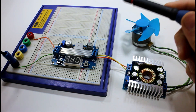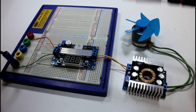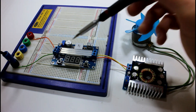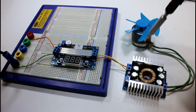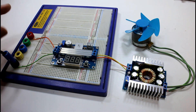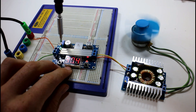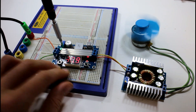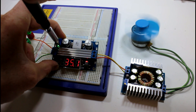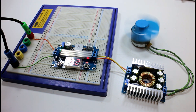I have a fairly big 5-volt power supply just off camera — you might be able to hear the fan running on it. It should be able to supply maybe three or four amps if needed. To get up around 30 volts — it says 40 volts but I just set it to 30 to avoid going too high and damaging anything. I've now pushed it up to about 36 volts — that's plenty, no need to go to the full 40.